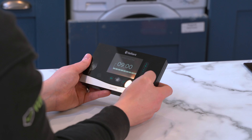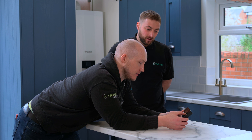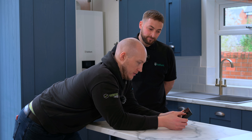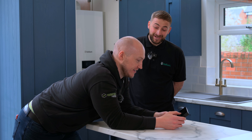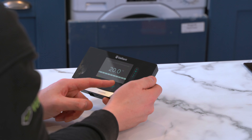Once you've decided which time you want to select — let's do 9. A lot of people set the target temperature quite high. What would be a sensible temperature? My heating at home is based at about 19 degrees. When we put it on, we normally have it go up to about 21 degrees. My heating at home is set to 19 degrees when it's on and my setback temperature is 16. The setback temperature is basically the coldest it will let the house get. Let's get it a bit toasted — 20 degrees.